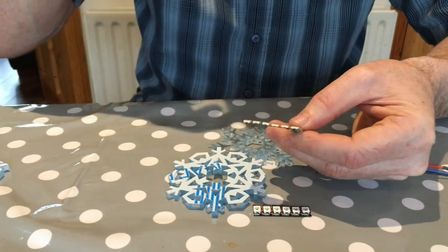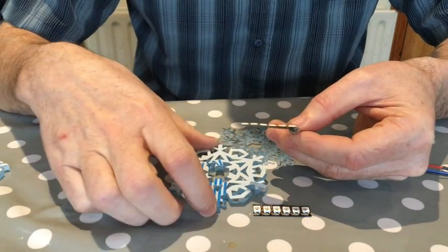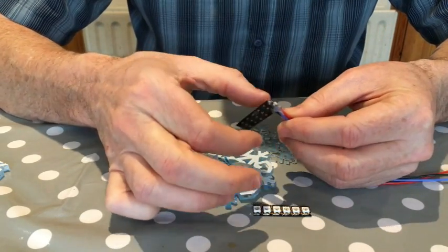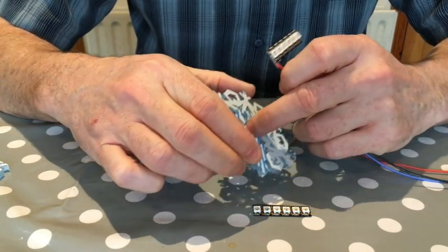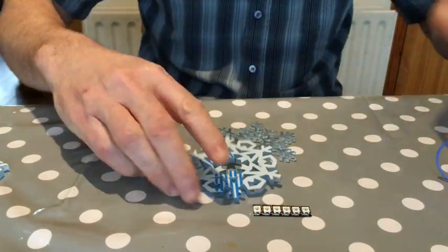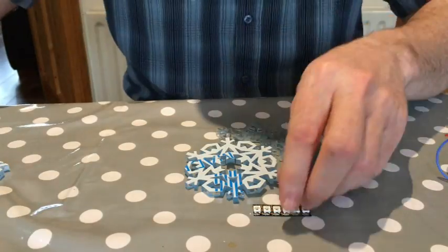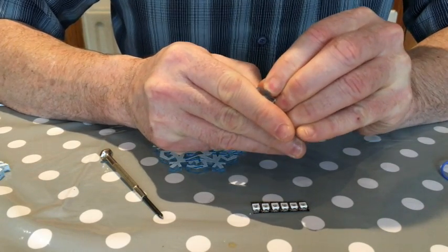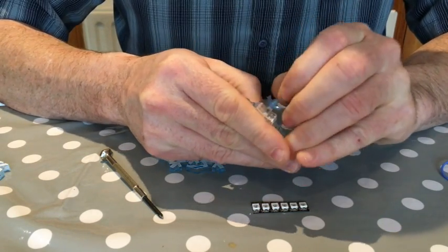The snowflakes are cut with a 16mm hole in the middle so that when I make a hexagon — or a circle, close enough — out of the LEDs, they fit perfectly. I bent the LEDs first, measured the diameter, and then designed the snowflakes around the LEDs. Here's an example of the snowflake once it's peeled.